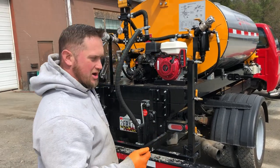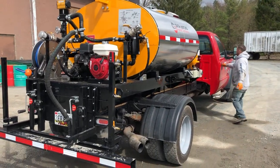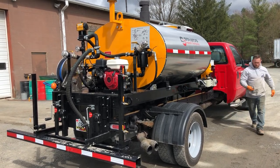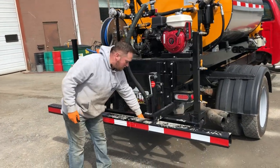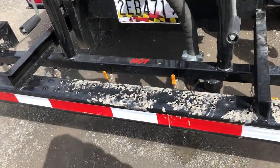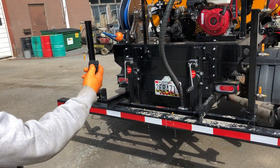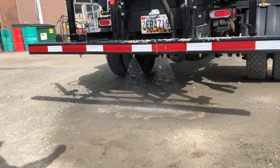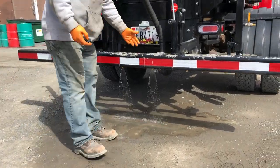What that does is allow you to click a button — I'll go get the controller now — so that you can switch between recirculating back to tank and allowing the material to come out of the spray bar. I'll just open up two valves for right now. This is a 6-foot bar with 3-foot extensions on each side, so it'll fold down and be a 12-foot bar altogether. Literally all you have to do is press a button and that'll give you the spray that you want. Hit it again to turn it off.